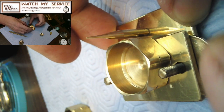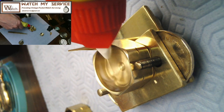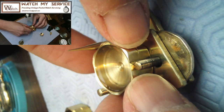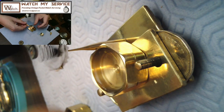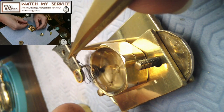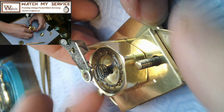I just want to be known as the inventor of the Binford 5000 Balance Lifter. Alright, what the heck — let's actually dip the hairspring. I changed my mind — I'm going to fill this up with some Ronsonol lighter fluid and test this baby. You very carefully fill this up. Do not smoke while you're doing this, please. There it is — the balance cleaning lift is now filled with lighter fluid.